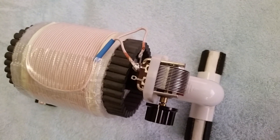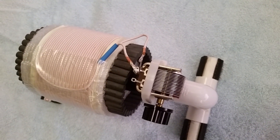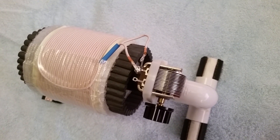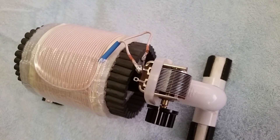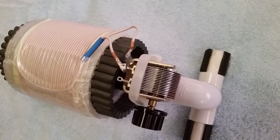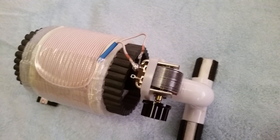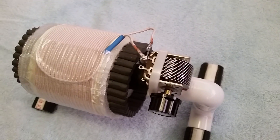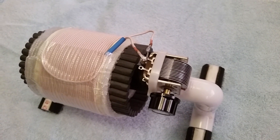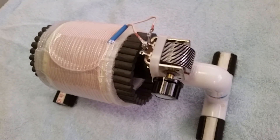This particular Litz wire, although it's very, very high sensitivity, because of the large diameter it does require a 60-watt or larger soldering iron or gun to successfully prepare it for this project. If you wanted to make one of these with the highest sensitivity Litz wire, you won't be able to melt the solder with a 25-watt standard pencil type soldering iron.